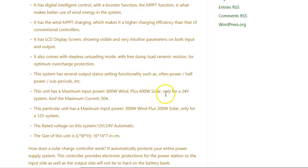When you have it set up as a 12 volt system, the wind power will be able to put in 300 watts, and the solar will be able to put in 1200 watts. That's the maximum the controller will put into a 12 volt system.